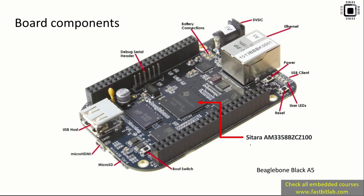This board comes with a pre-installed Debian OS on eMMC, and by default it boots via eMMC. That's why when you give power to the board, the Debian OS stored in eMMC runs. In this course we will not be touching the eMMC memory; instead we are going to install the Debian root file system and boot images on the SD card, so your eMMC files will not be affected.